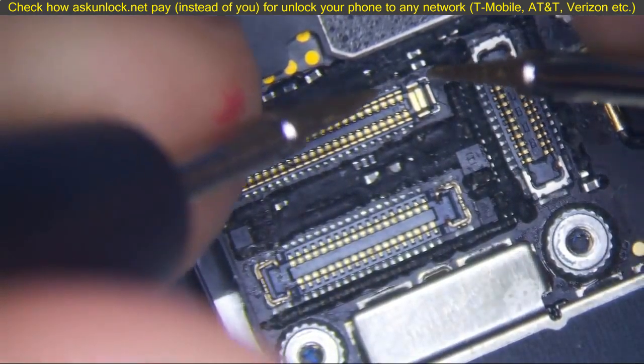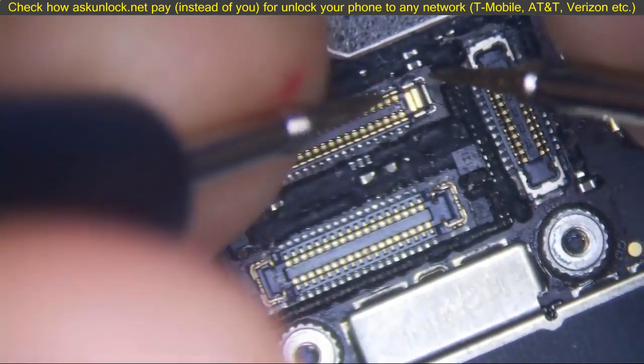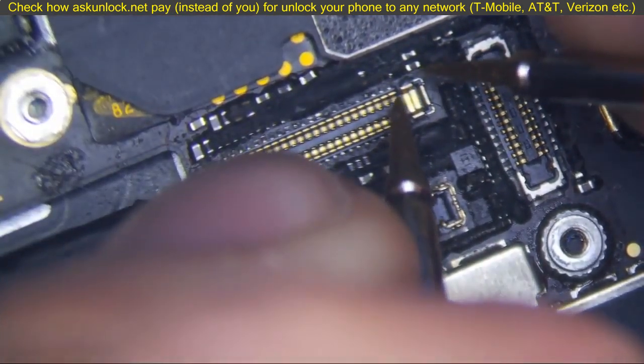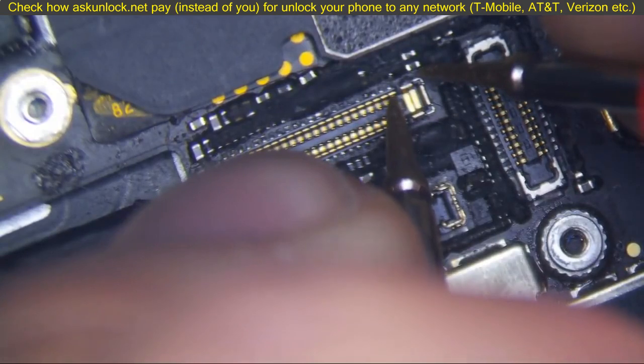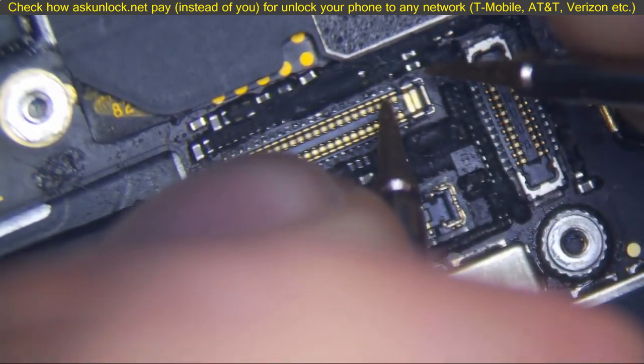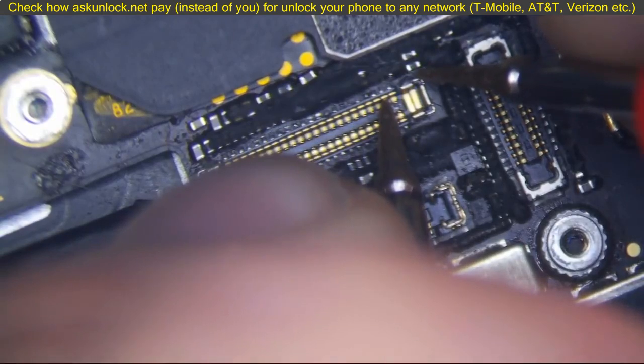So, voltage mode on the multimeter. This first pin is one of the backlight. There's 3 backlight pins. So let's do this, ground. So this is 0.2 volts. And then this is the big one right here. Don't short that sucker. So this is 3.8 volts, okay.